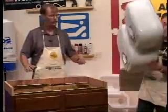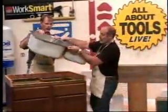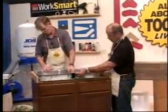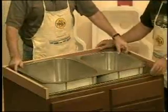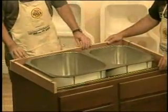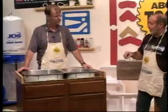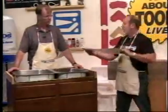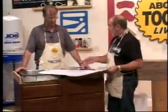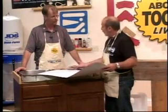So let's go ahead and just put this up. Actually, this goes to the back side. And the key here is, again, notice the irregular shape of the bowl. But because of the way this bracket is designed, we end up with perfect perimeter support of this bowl. Because this manufacturer also supplies us with a template, the template would already be cut in the countertop, and then you would just set the countertop on, silicone this in all the way around, and then jack it up in place.